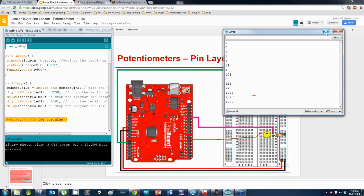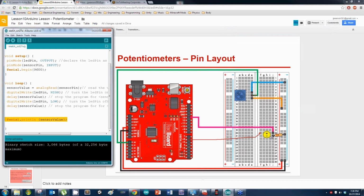So now the only issue I see is here in your actual circuit. You must not have the LED grounded with the resistor, or the wire is not plugged into pin 6, or you have a bad LED. Okay, let me check and see if I've got the LED plugged in the right place. Oh. No, I don't know. Cool. What was it, Jay?